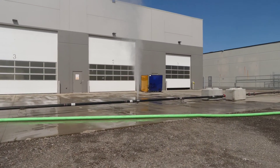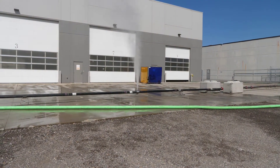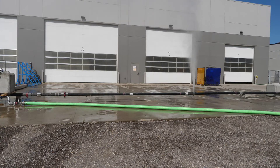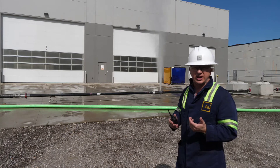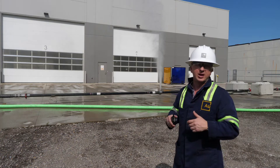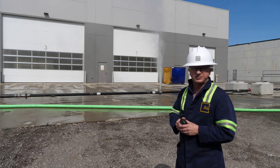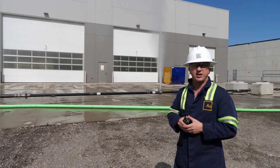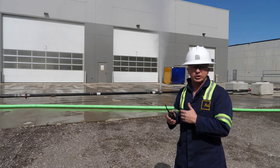What pressure are you reading right now on the line? We've got 22 MPa across this particular sleeve right now. This restrictor in the sleeve was designed to test inside, so that's why we don't have a huge amount of water coming out, but if the sleeve was wide open we'd have whatever fluid is pushing through it spraying everywhere. So we've got about 22 MPa or about 3000 psi across this sleeve — 3000 psi differential across our dart, isolating stage two from stage one.